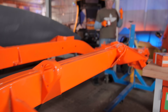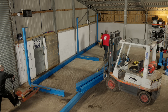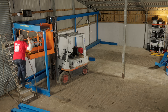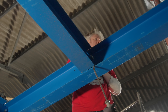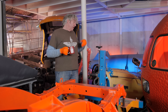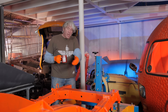Another thing we teased in the second Ferrari video was the building of our office building — a brand new building inside our existing workshop building. The reason is it's so cold in here, it'd be nice to have a warm refuge. We're going to build it the same way we did the mezzanine — lots of steel structure, then wood and floorboards. We're going to clad it with windows and insulated walls so we can heat it up and keep it nice and warm. We're also going to do underfloor heating. That's going to be our next video, hopefully next week.